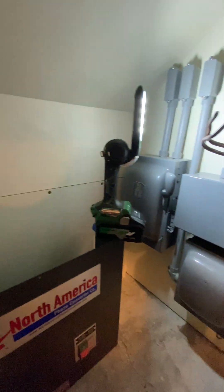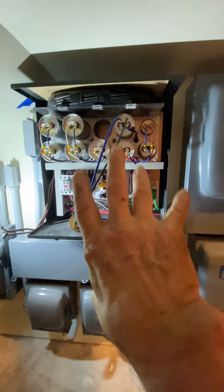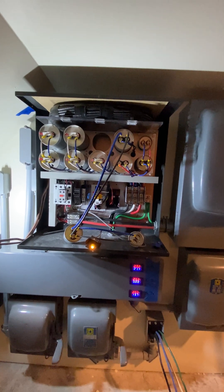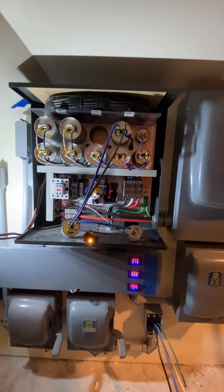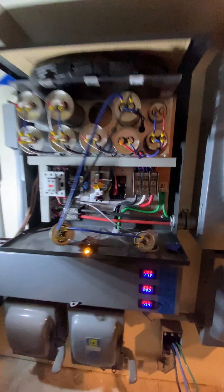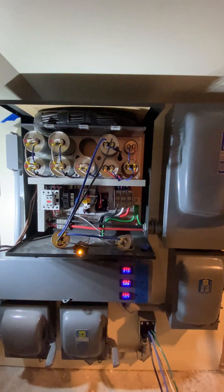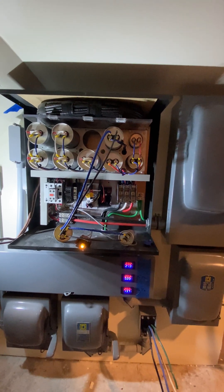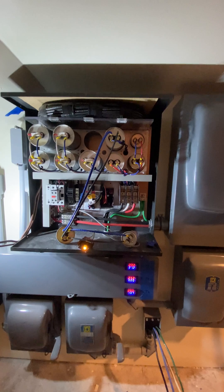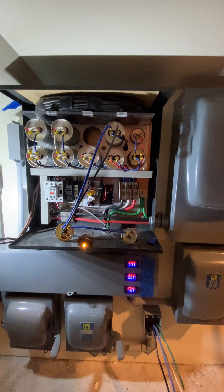The idler you can't hear because it's inside that compartment. When I ordered this from North American Rotary, they also supply a motor, but I had a motor — my motor was super high-efficiency, low-speed, made by Leeson. It's a metric motor, inverter duty, very nice motor. The capacitance of that was for an eight-pole motor, and they normally run a four-pole motor, so it's very quiet and the capacitance isn't the same.